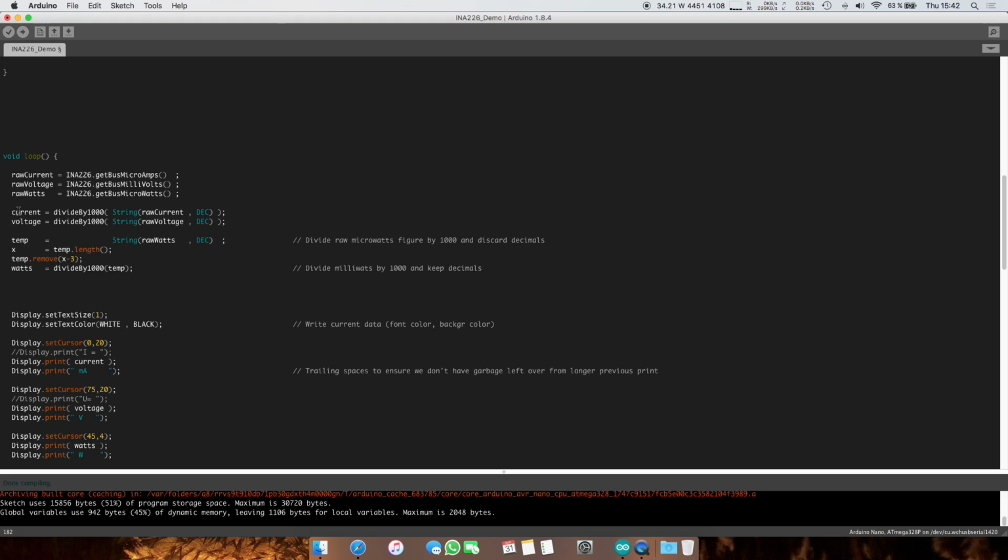Now that we have these current and voltage strings that look nicely, current will look like, for example, minus 23.452 milliamps, and this might look like, let's say, 0.125 volts. Is it volts? Millivolts divided by 1000 it is volts.